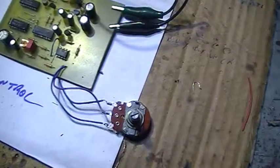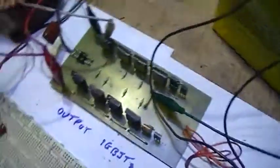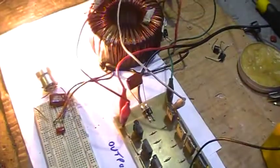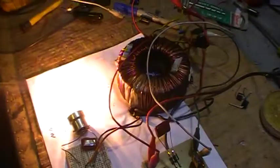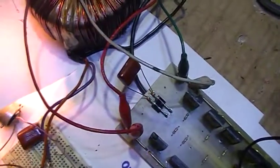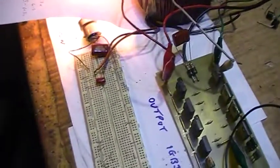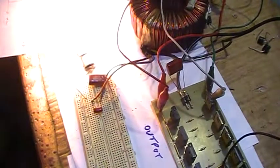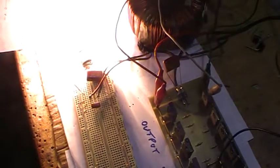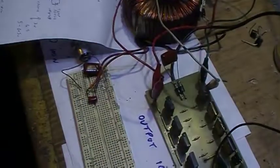I've still got the manual V-sense control, but I'll fire this thing up and show you what I've got here. By turning this pot, we can quite neatly bring up the load — it's probably a bit bright to the camera, I'll put a piece of paper over there so you don't get deafened by photons. As you can see, we can bring it right up to the point where it thinks it's overloaded and it'll just suddenly drop off.